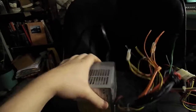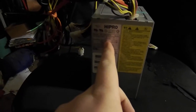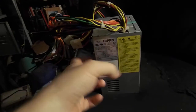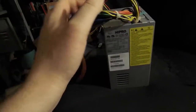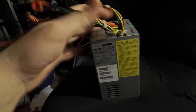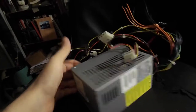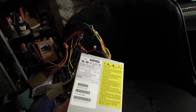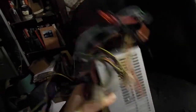If you want to run an amplifier, then you need a little more juice. Boom — computer power supply. Computer power supplies usually have a higher amperage rating. This one is 10 amps. I think this is a weak power supply because it's out of a proprietary HP system — it's smaller than usual. But you can get power supplies with really high ratings on the 12 volt rail. I think I have one here that's 30 amps. People don't think of it that way, but a computer power supply can run many, many things.